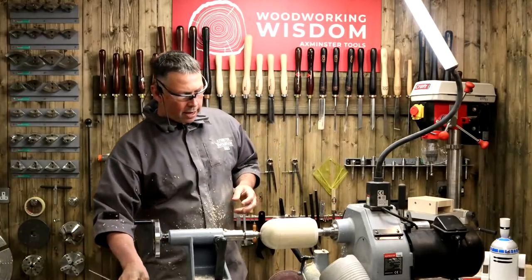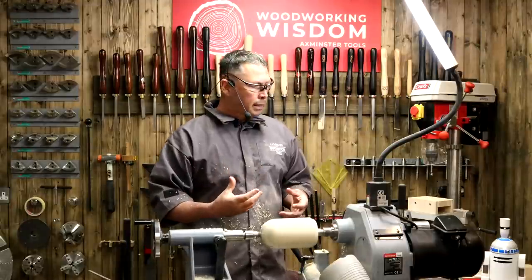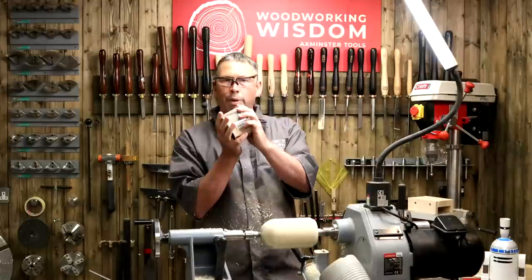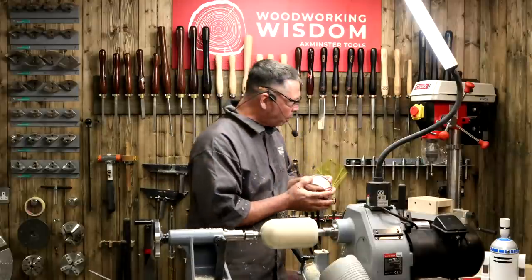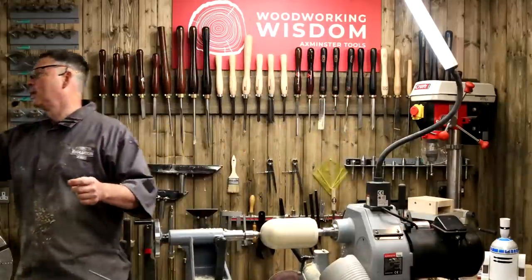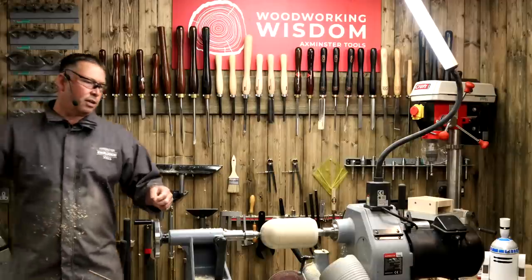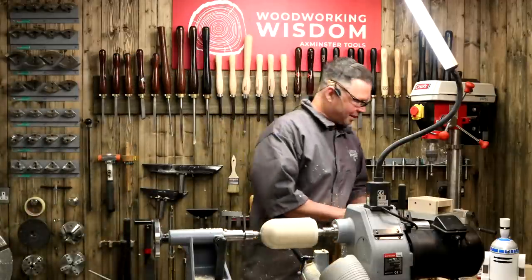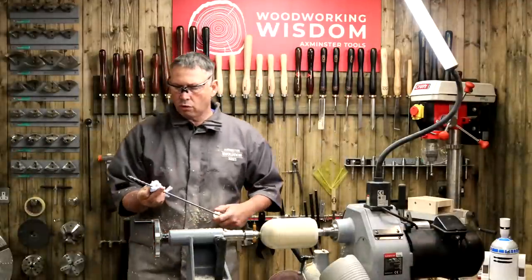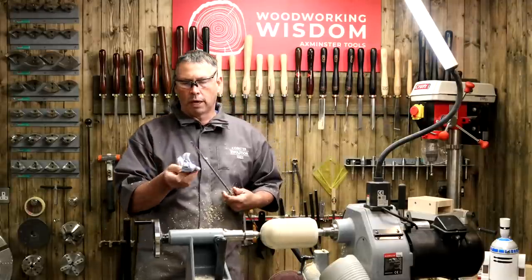Now, what can happen sometimes, because this timber is particularly dry, and all the tulip we get is kiln dried, you get a little bit of friction. So a bit of wax helps, any of your paste waxes will work. Apply it with a tissue. Don't be tempted to use your finger to put paste wax on an auger, especially when you've used it, because you'll do one of two things: you'll either cut yourself or burn yourself. A little bit of paste wax, just on the main shaft of the auger, stops that really loud screeching.